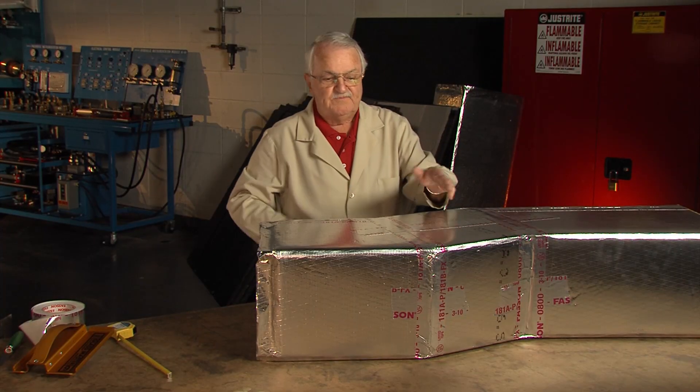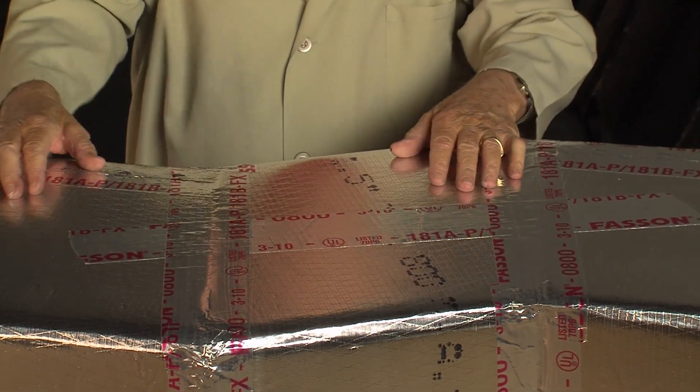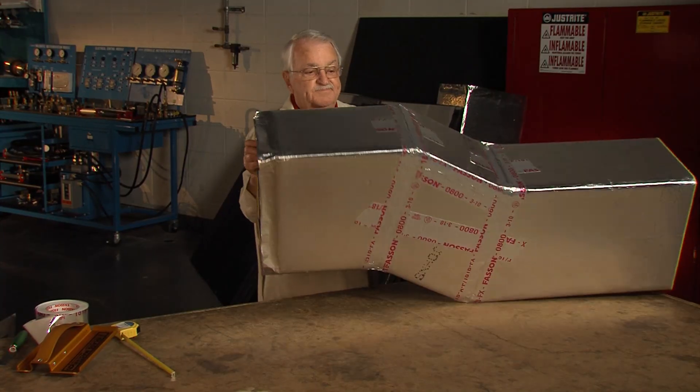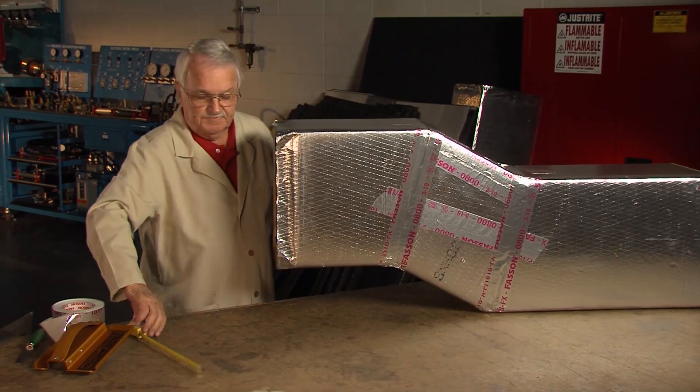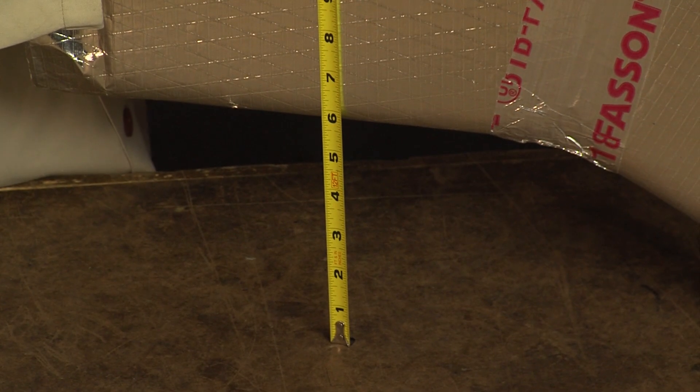So I used 15 degrees and doubled the offset, putting it between these two lines, and the offset comes out without any problem. This is a six inch offset — I put 12 inches in between them. There's your six inches.